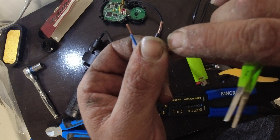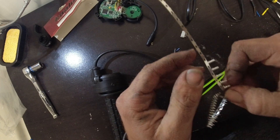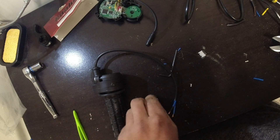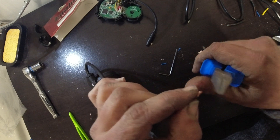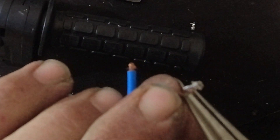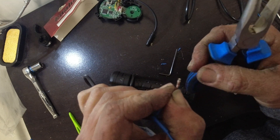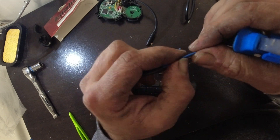I like to fold them over so they clamp better into the little clips that we're going to clamp them into — to make our own little hot glue plug. Now we grab the clips — three of these. One, two, three. With the clips, I like to hold them in there like this, push the wire in. I like to put the wire in like that and just squeeze it tight. Fingernails are good here too. Grab that little tab and bend it over and compress it so the heat shrink will slide over that. Lovely. I've got all the connectors on.